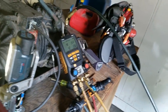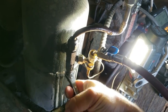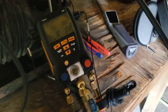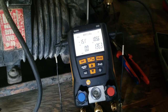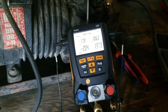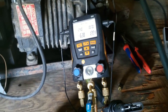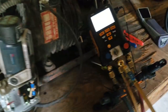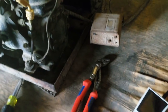It does have a packing nut there, so we might be able to close that thing off. Also, while we're doing that, we'll be able to test the pressure switch and make sure it cuts off. I don't want to get too crazy with it. So your low pressure switch is not good either.